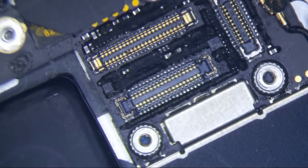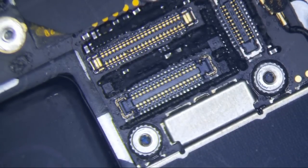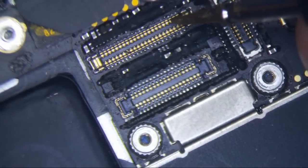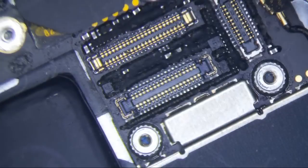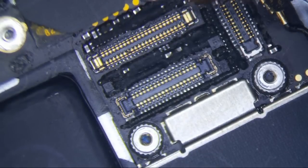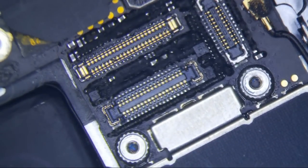People think the screen is off and they can remove it and put the screen back on. But as soon as they put the screen on and these pins short — this second pin shorts to this one — this filter right here blows. That's the usual culprit because that is the big voltage/current pin. You'll see a puff of smoke come from the logic board. It's that filter right there that blows.